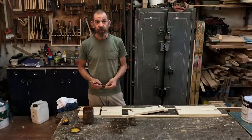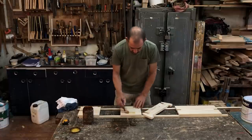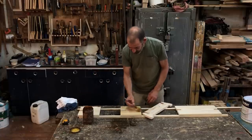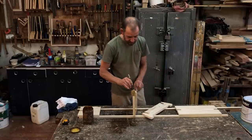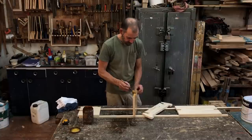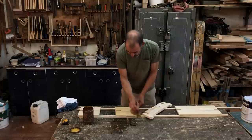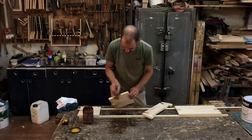That's why we use a lot of turpentine — to make it thin. When applying with the brush, work it into the wood. You don't have to worry about brush marks; your goal is to get the oil to penetrate. On the end grain it's going to drink up a lot of oil, so give it plenty and really work it in. You don't want it dripping in oil, so keep working it so it soaks in.